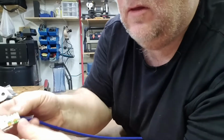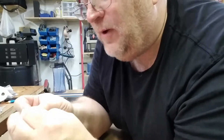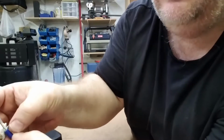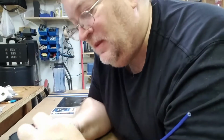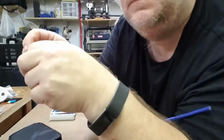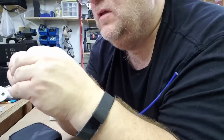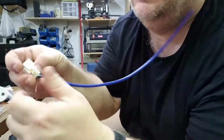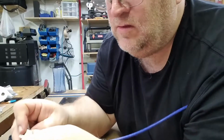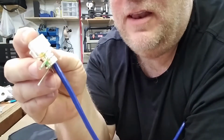On your keystone, wire them up so that your green-white is in the pocket. The wires are somewhat centered. On the last, you don't have a whole lot protruding here. And then insert the green in the next one. We're just going to run them in by hand at first. Now your wires are sitting down like that.